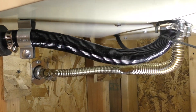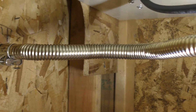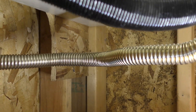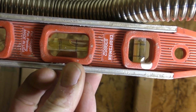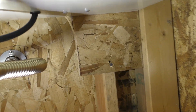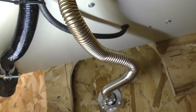So here's what I did. The exhaust flange mounted to the wall would have been better if I'd sized and mounted it a little lower. Since changing that would be very difficult, I raised the unit up about three inches and remounted it onto the wall. That allowed me to get a nice bend in, and although not a drastic angle, I was able to get at least a slight angle all the way back toward the exhaust. For the excess pipe, instead of a downward angle bend, I put a saddle bend in it horizontally so it takes up the slack but still has an overall downward slope into the exhaust flange.